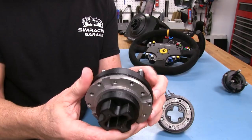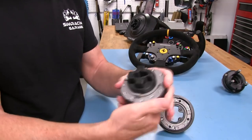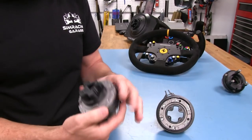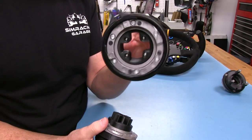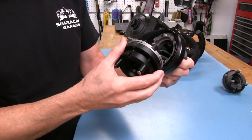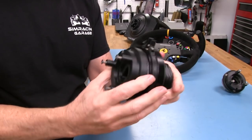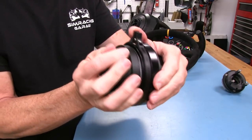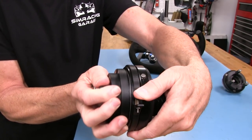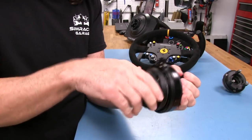You can see some 3D pieces mounted to this. We have a big lug — the Thrustmaster typical three smaller lugs with the big one that makes everything line up — and the same thing has been 3D printed. So basically we put this in, then turn the outer part clockwise, which locks the inner part. This pin pops up when it's locked in. See how it slides and then the pin pops up? Now we're locked in.